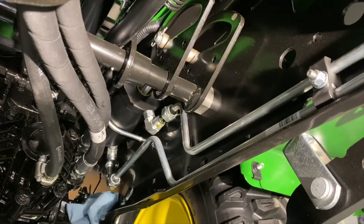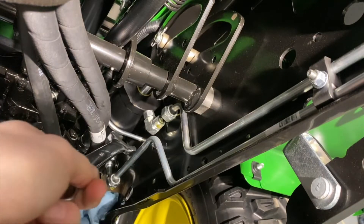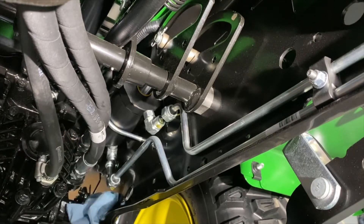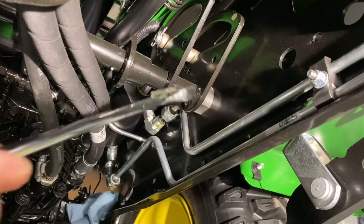Now move the shaft. It just says to slide the shaft to the center — it moves over pretty easily. Next steps 10, 11, 12, and 13. Step 10: remove two nuts and the U-bolt holding the lift cylinder to the machine frame. There's that U-bolt going around the cylinder. Then remove the cotter pin, two bushings, and pin from the cylinder rod end — that pin right up here. Remove the pin through hole C on the outside of the frame, then discard the U-bolt, two nuts, two bushings, and cotter pin.